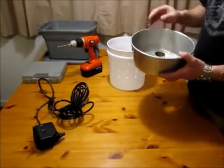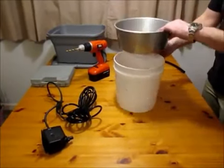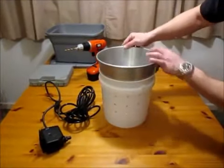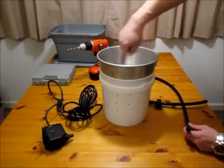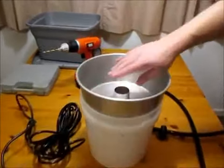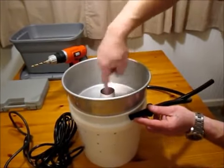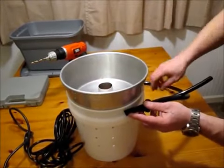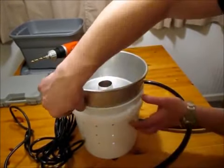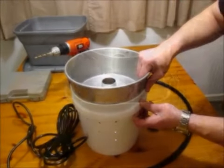As you can see, I used the sharpie and got my line. I cut the center out where I wanted it. Looking pretty good. I know that my water is going to spin inside like this and go over my cone, so I want my water to come in at the same level as the top of my cone, if not in the middle. That way when it creates the vortex and cyclone, the lighter material goes over the top, and I can adjust my flow. If I have to, I'll notch out the bucket so my line can go in.